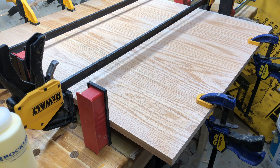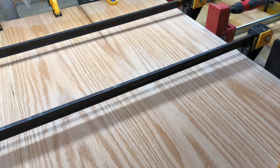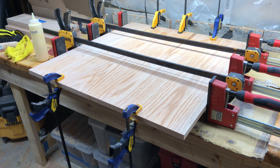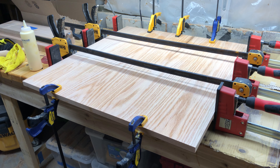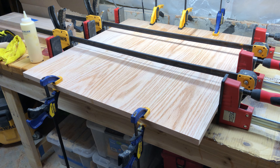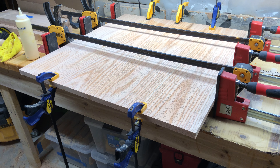After a couple of minutes I used a damp cloth and wiped all the seams clear. Some people might be wary of doing that because they think they'd wipe out some of the glue, but I used this same wipe-off process on the last tabletop I made — this is a set of two end tables — and the seam was perfectly flawless.